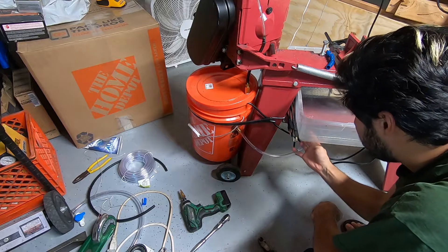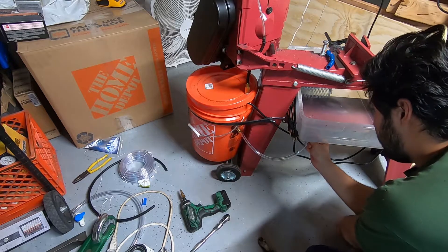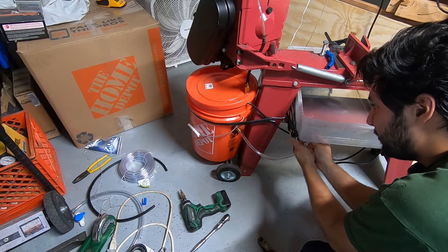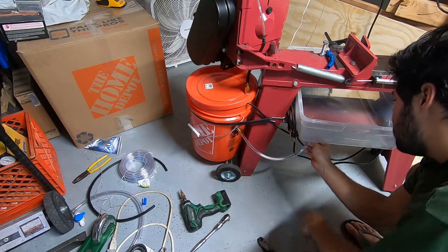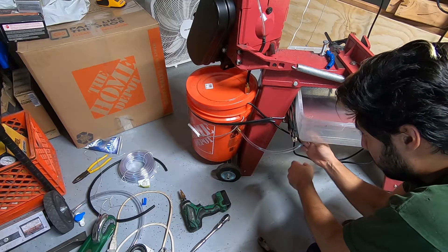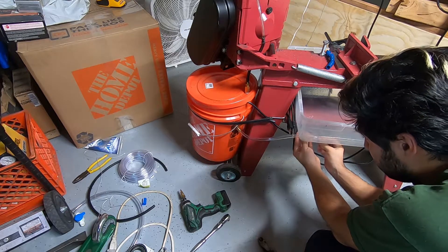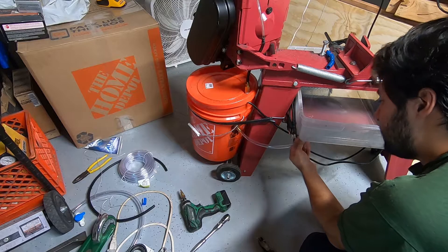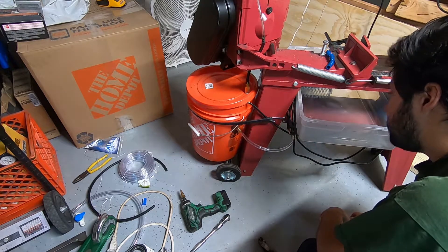The main thing you want to make sure is that you don't have the hose drooping down a lot, because then whatever drains is going to get caught in there. If you have particles in there, it's going to potentially clog because you only have gravity draining here — there's no pressure in the system, no vacuum on the other side. So you'll want to make sure that it is smooth and gradual. Maybe that means putting a 90-degree fitting right there so it's nice and smooth, or just a straight fitting.